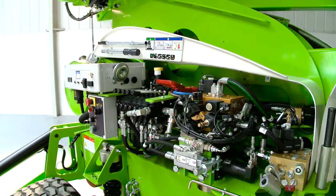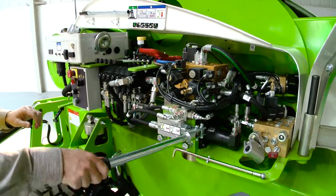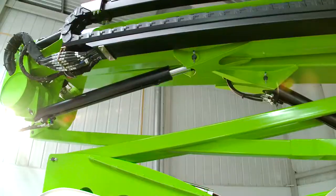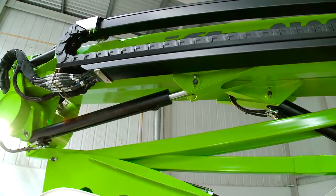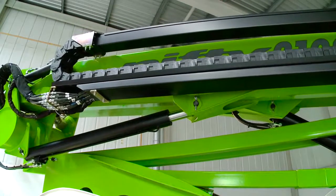The SD210 also features a manual hand pump at the base, which, when used in conjunction with the function controls, allows the machine to be safely lowered to the ground, even without main power. The hydraulic outriggers can also be operated in this manner, so the machine can be completely stowed away without any power if necessary.